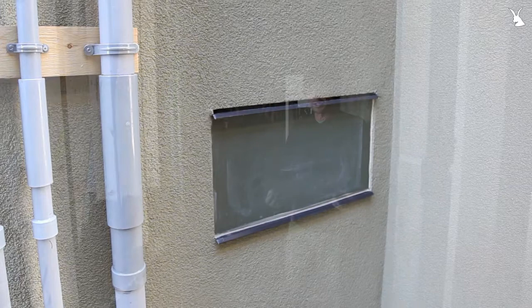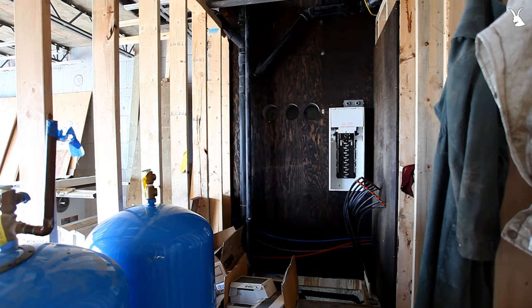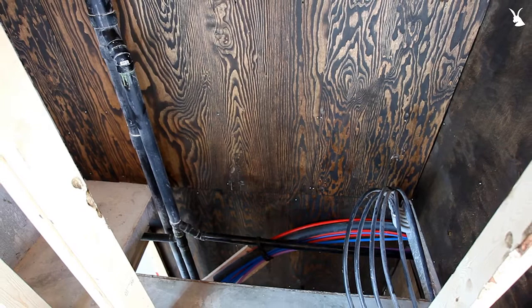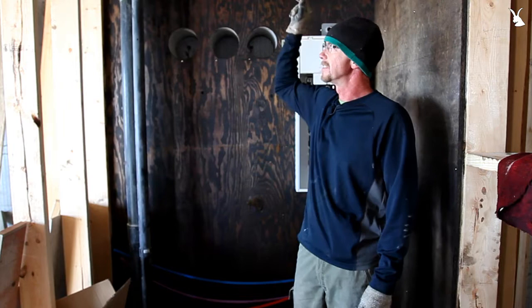We have a utility room on every floor of the house. Realtors look at me and say, what are you doing, you're wasting space. But the main reason is we have a utility run that goes from the basement all the way to the top — it's two feet deep, five feet wide. This allows us to more easily install all the plumbing, electrical, and HVAC. More importantly, it's faster and easier for repair. And if you want to modify the system later — say, put in a forced air furnace — you can, because everything is accessible. We have access to the ceilings and floors on every floor of the house.